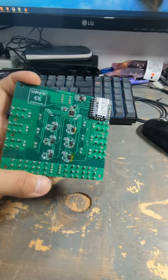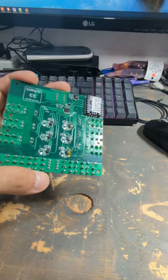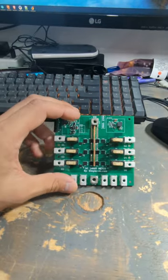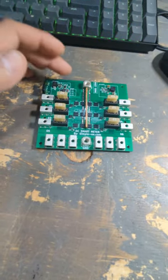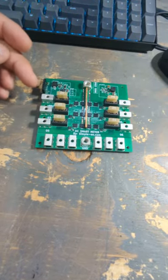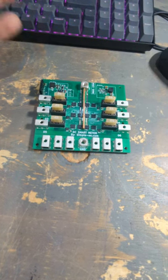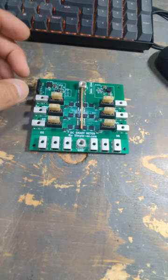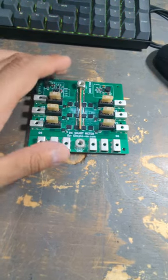Another cool thing — since I'm using the ESP32 Pico I'm planning to do self-hosted InfluxDB, so I'll be able to transfer and log all that data. I can look back and see, for example if I'm using this as a load breaker, how much each circuit is being used and graph it. Or if I have multiple batteries in parallel, I can see how much solar goes to each battery.